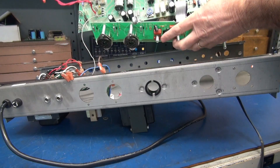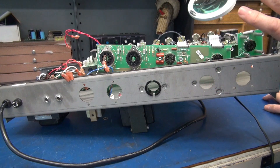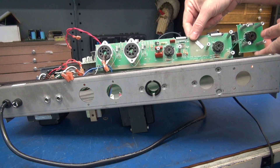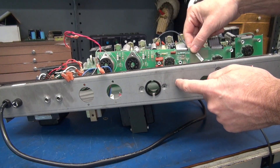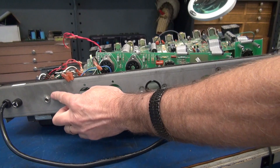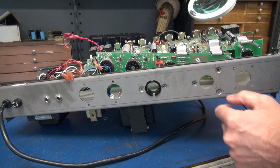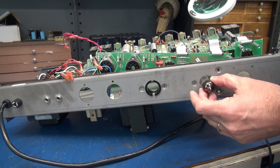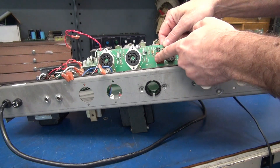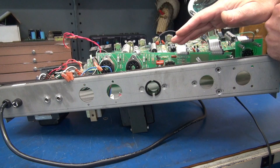I got the circuit board ready to remove, but I needed to point something out real quick before I do that. The AA 1164 has four 12AX7 tubes — this amp only had three, so I'm going to have to add a hole here. It also has a rectifier tube, so we're going to remove these speaker jacks and the rectifier tube will sit over here. These will be our two output tubes. But if you take a look at these holes, you can see that a 12AX7 socket probably won't mount on there too easily. So what I'm going to do is use a standoff method and build an aluminum backplate just for the 12AX7s.